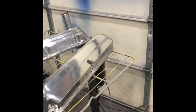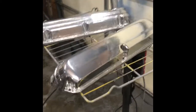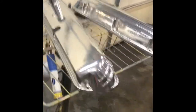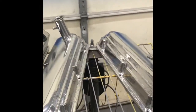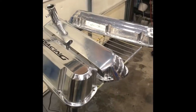I pulled these out of the oven. The specs say you're supposed to have this fully cured — bringing it up to 400 degrees for about 15 minutes for the actual part — then let them cool down to about 90 degrees, and then apply the black chrome as a second coat. The finish on this is pretty awesome, and for 12 bucks a pound I'll take that all day.